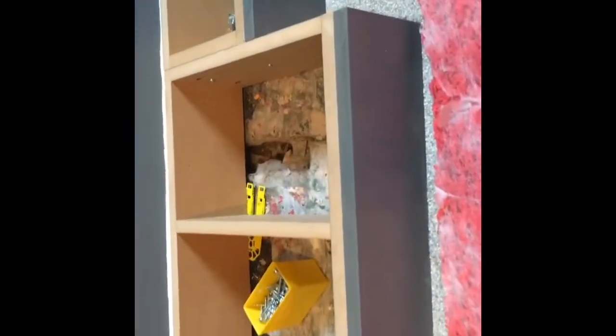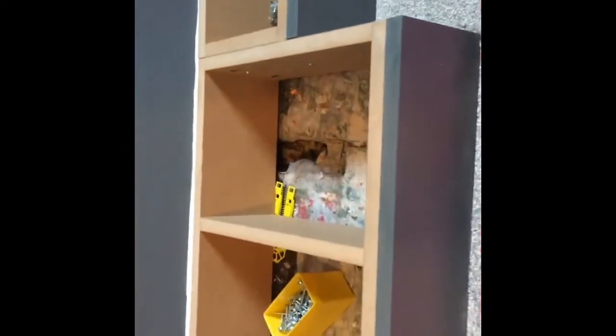But what I'm also doing at this stage is putting the plinth fascia parts on. These are pre-painted to match how the rest of the unit will be. So they've been scribed up to the skirting. And in this particular unit, we've got this brake front, this bit that sticks forward. Now they're just fitting simply to the front of that because there'll be a side panel that will come down and cover that after.